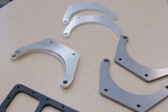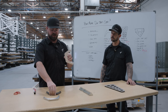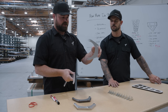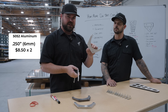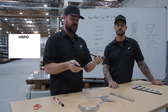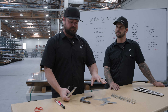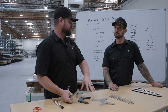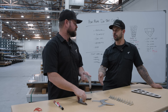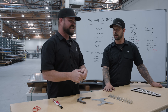The first thing I want to talk about - I made one part in three different materials. The first is 5052 aluminum, all a quarter inch. I also have HRPO and 304 stainless. This is a relatively simple, pretty small part. These were about $8.50 each in a quantity of two. Same thing in HRPO - hot rolled pickled and oiled mild steel - these were about $8.50 as well. So even though they're wildly different materials with different alloys and completely different properties, they're similar in price.